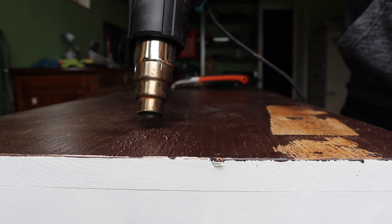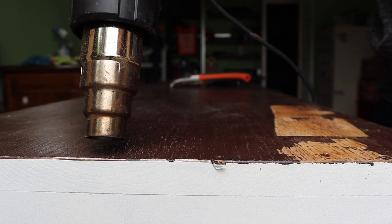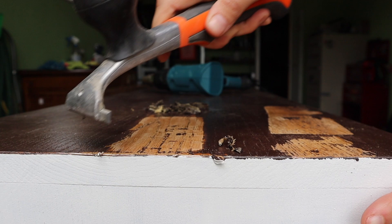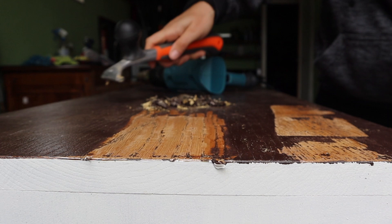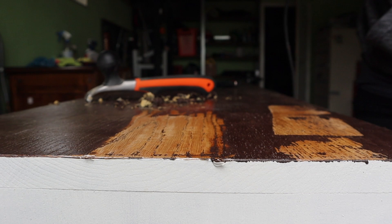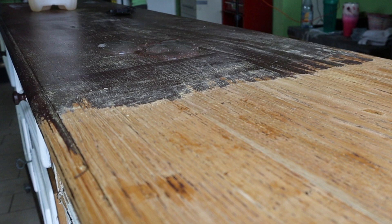What you want to do is be patient and watch while the paint bubbles up. Once it bubbles up, that means the finish has been compromised and you can scrape it off. Don't get too close and don't stay in one spot too long because it will start smoking. Then I take this paint scraper — I'll put it in the description below — which will pull off that paint once it's bubbled. With a heat gun you don't have too much of a mess, but you do need to wear a mask. Going into ornate areas is a little bit tougher with a heat gun.